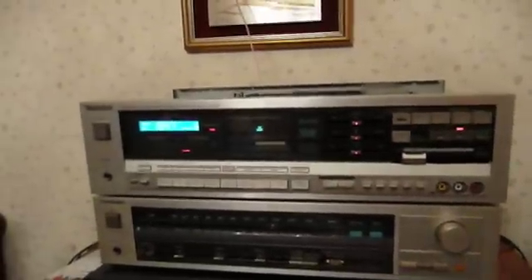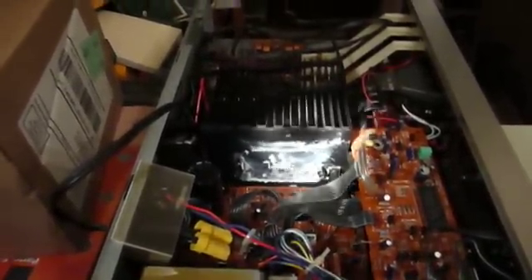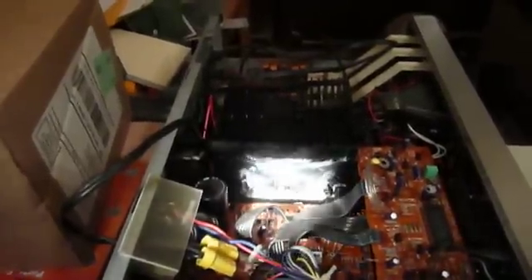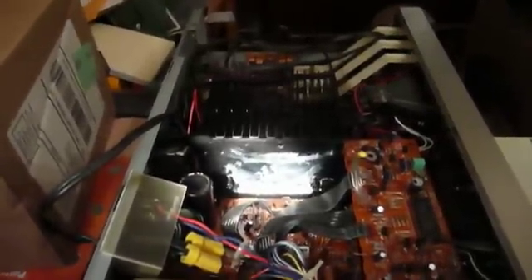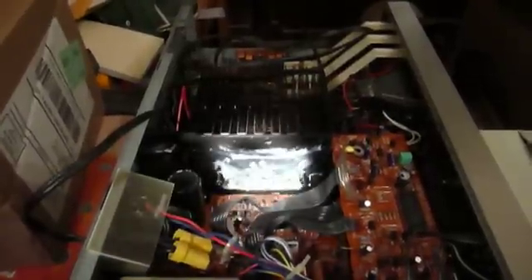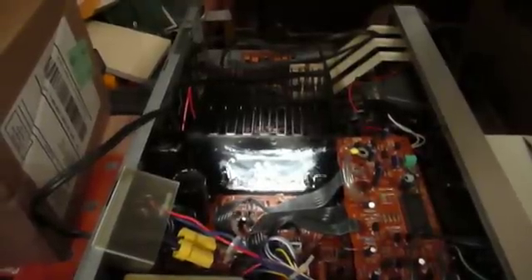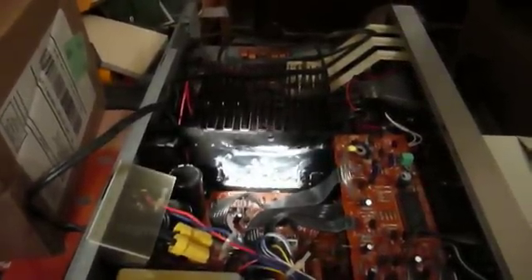Anyway, there you have it — a successful repair. Then there's the poor SA310 receiver, whose hybrid output I blew out while playing it a little loudly one day. The left channel got weaker and weaker, then finally died, and my DC protection box sitting between the amp and the speakers tripped. I'm guessing the amplifier module got progressively worse until some of the transistors inside failed in the on position and left a power supply rail in an attempt to burn out my speakers. The problem is I need an STK module for this thing and can't seem to find anybody selling one for a reasonable price. It's kind of an unusual part, so if anybody's got one in their parts box, read the description on my video to know exactly which part I need — I'd be real interested in acquiring it, because I'd like to get this little receiver going again.